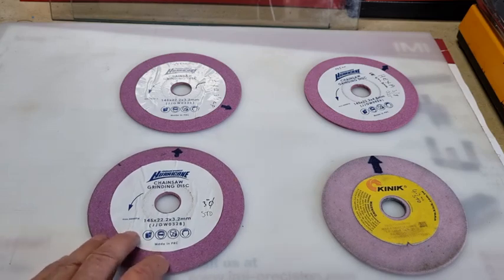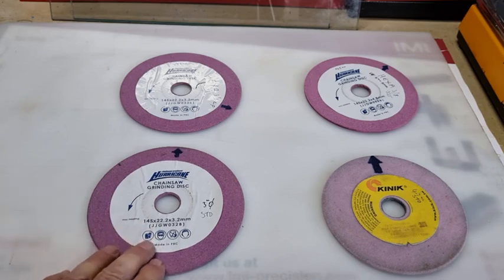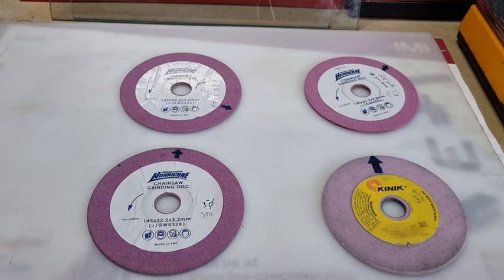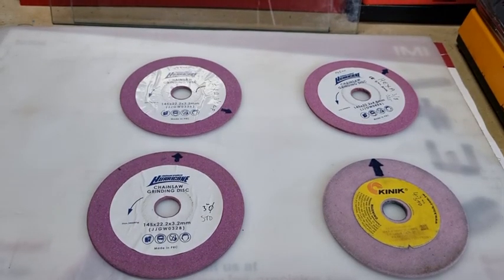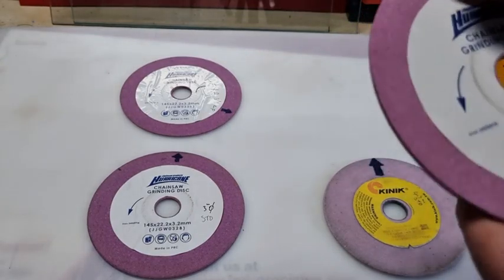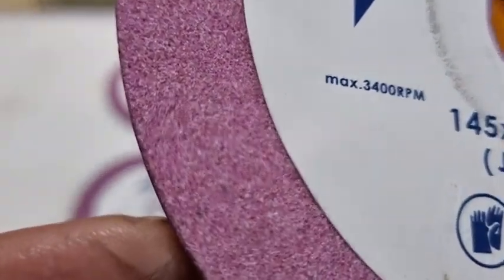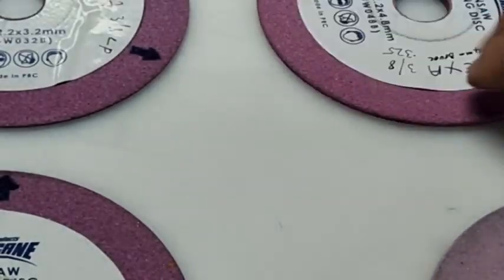You have to be careful even when talking about grit size — how good is it, does it have sharp edges or round edges? During the process of putting the molten glass together to hold it all, some manufacturers have better processes than others. A 60 grit is going to give a rough grind, so you're really looking for about an 80 grit. You can really feel the wheels. If you're going to purchase a wheel, look at it closely, look at the surface — it should be pretty good and even. Look through magnification at the edge to see what it looks like up close.